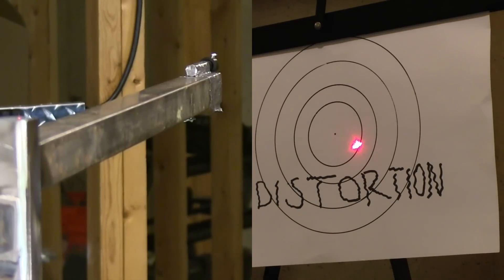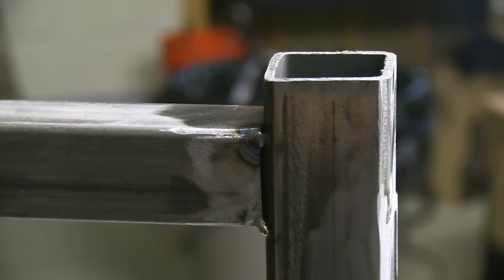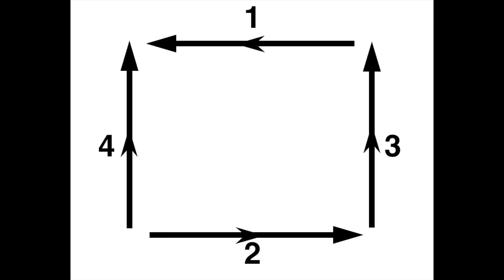This one didn't come out perfect — I'm shooting down and to the right — but that's 25 feet away, so it's not much distortion. I found that for a joint like this, a sequence works really well: weld the top first in one direction, then the bottom in a different direction, then both sides vertical up. That came out really close, and it also works for round tubing saddle joints at 90 degrees — part of the top in one direction, part of the bottom in the other, then uphill on the two sides. The top and bottom get locked in and there's very little movement after that. Hope you got something out of this today — please subscribe and hit the thumbs up if you liked it. See you next week!